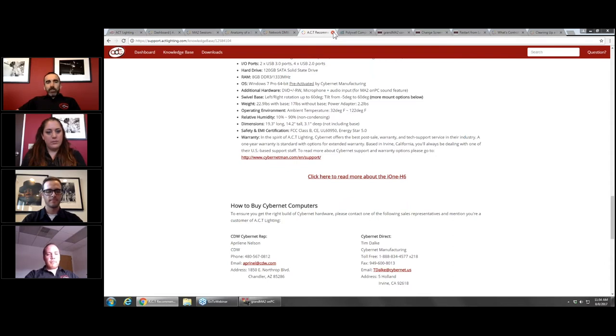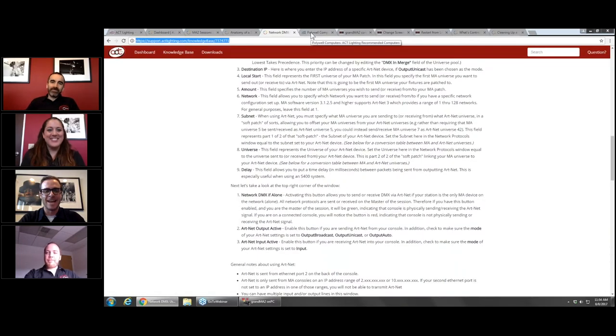Somebody asked a question, networking and wireless. Should you join your consoles together through a wireless connection? No. Absolutely not. Please don't. Sessions are not designed for wireless communication because Wi-Fi has its own kind of clock cycle, which affects our real-time synchronization. If you want to control your console wirelessly, what should you do?